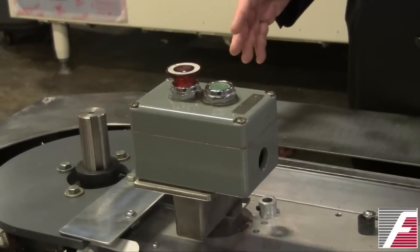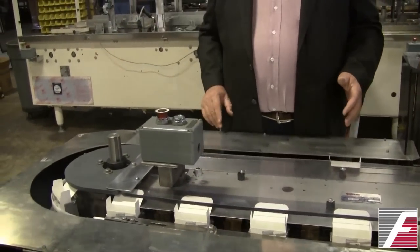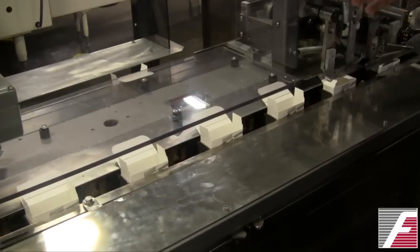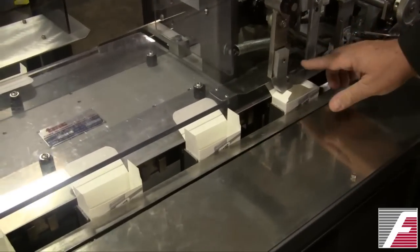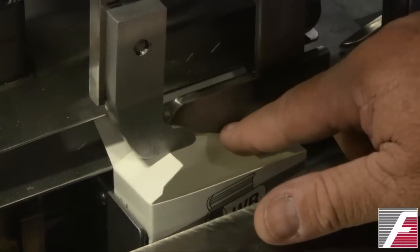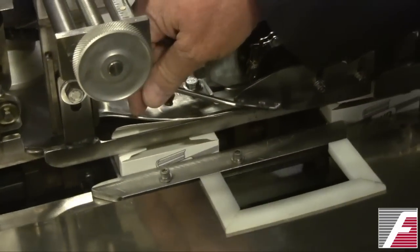In this area is where loading takes place. Once the carton is loaded, the top needs to be closed. The top closing process is very similar to the bottom closing process. The carton comes into a kicker section — the kicker kicks the trailing flap closed. You have a plow that's going to plow the leading flap closed. You then come into the folding section, and you can see this guide that pushes the major portion of the flap over.